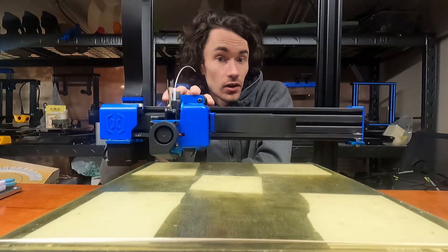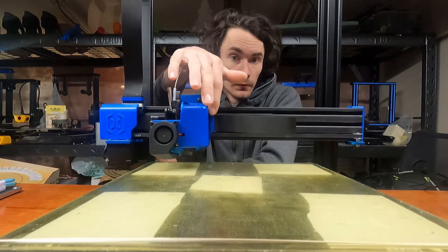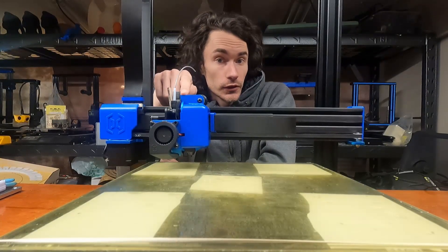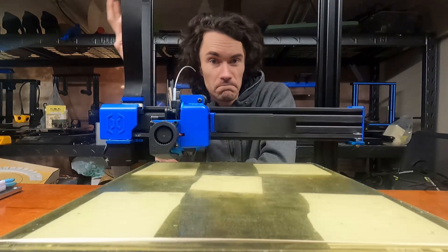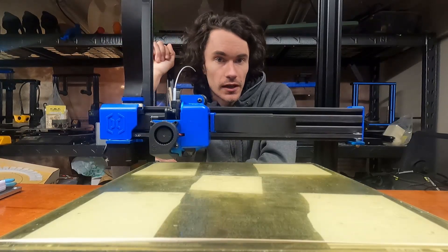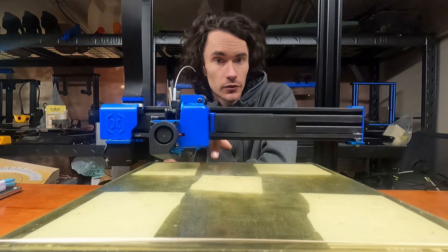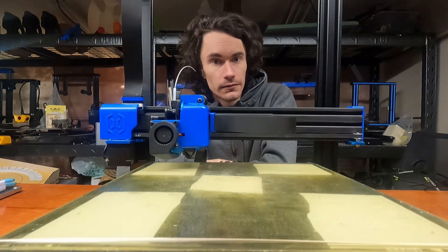The install of this was actually very simple. All I had to do was just remove the plastic clip, undo the two Allen screws that held this in place. It was a little tricky to reach one or two of the screws, but with a little patience — especially if you have a ball-end hex driver — you can get rid of it really easily. Then just reverse the process when installing the new hot-end assembly, take your time with the ribbon cable, make sure that's inserted fully, and double-check your nozzle gap between the bed, and you're all good to go.